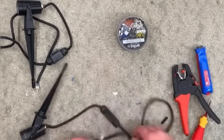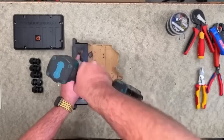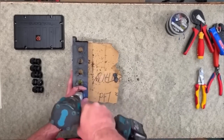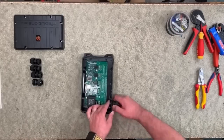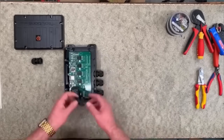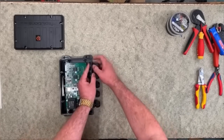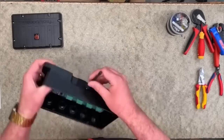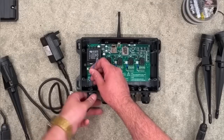Any Ghostbusters fans will know exactly what ectoplasm is. They're great little joints — ideal for this kind of application. Ferrules on the ends, just preparing them ready to connect into the R-IoT box. We drill out the entries — five 20-millimetre entries in there. The glands come with the unit and are rated to IP68. A lot of people forget when choosing glands that this sets the weakest link in the system — the gland needs the matching closure.